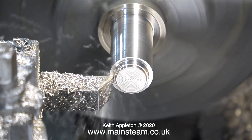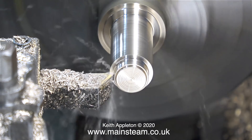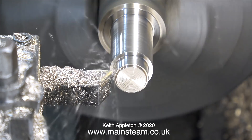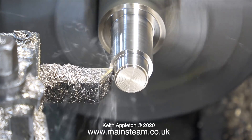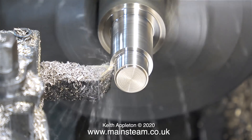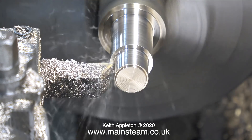In this clip I've disengaged the back gear, so the spindle is moving much faster, and as previously mentioned the chips are now going everywhere. There is a very simple method to stop this from happening: all you have to do is hold a piece of paper between you and where the chips are coming from. I can't do that for the video because all you would see would be the back of a large piece of white paper.